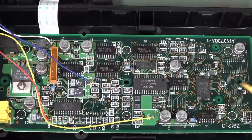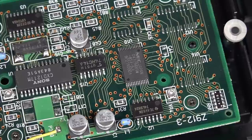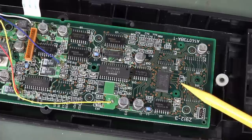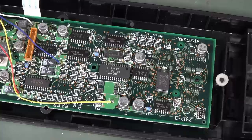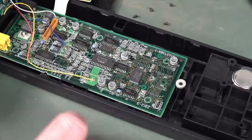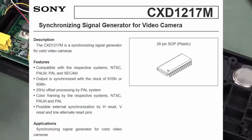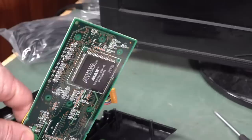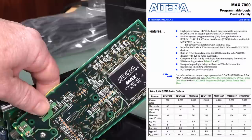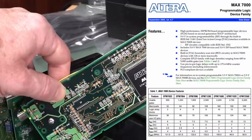I'll put a high-res photo on my Flickr account as always. That other part is a video sync chip - I'll put the datasheet up briefly. I thought I'd have a sneaky peek on the bottom - my hunch was right. Ta-da! An Altera Max FPGA on the bottom - that's how they're doing it. Going old school, implementing all that in the Altera Max. Back in those days they didn't have a huge amount of internal memory, so they're using external memory to map it.